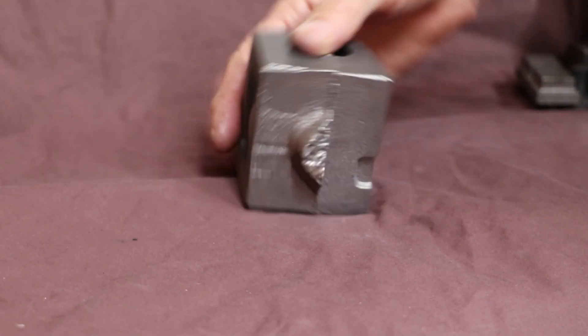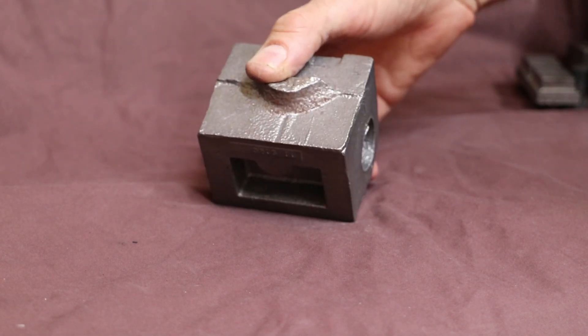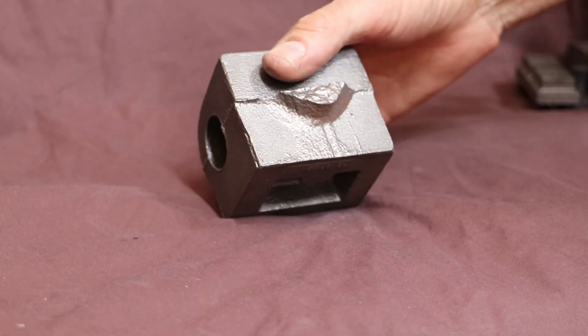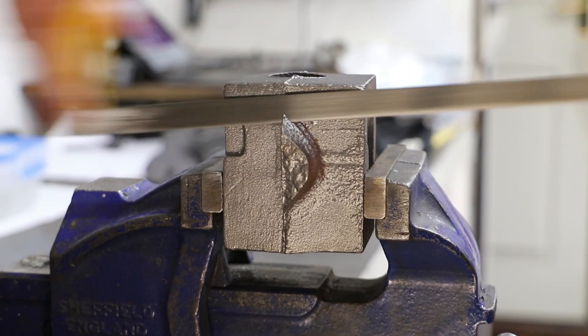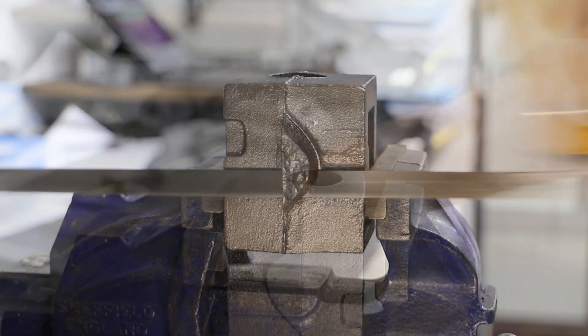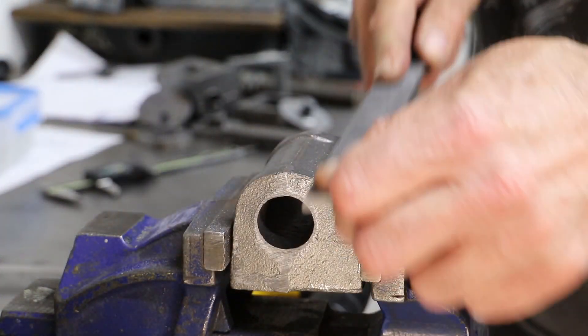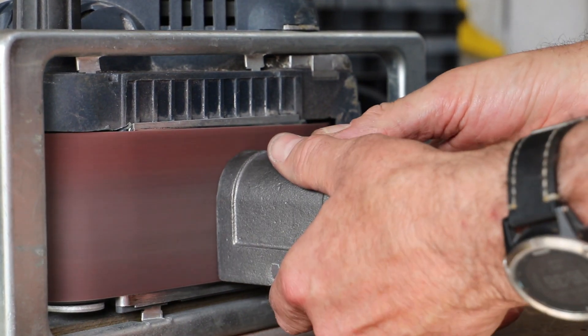In terms of machining operations my focus will be on getting the cylinder bored, and to do that I first need to clean up the casting, remove the flashing and in particular this big old lump on the top here. So I tackle that first with a hacksaw before moving onto a file to clean up all the flashing, and then finally I use a belt sander to give a real good clean up to one end.